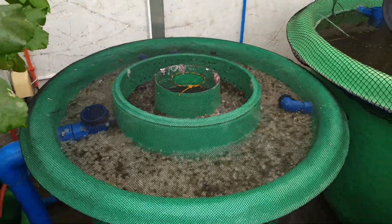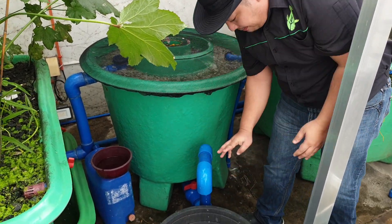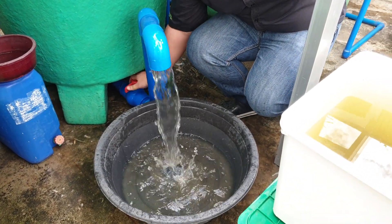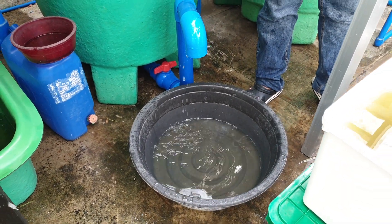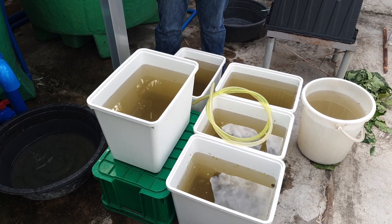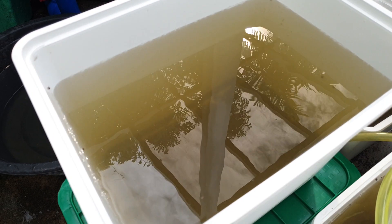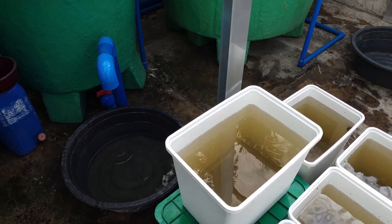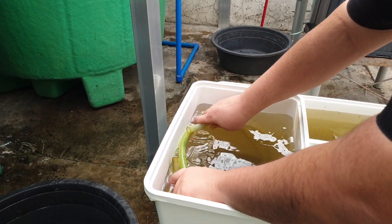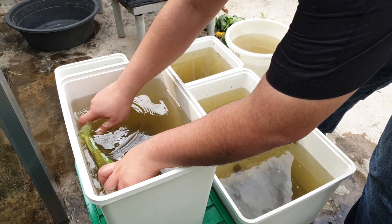Here is the drain of our filter. A while ago we used basins and pails to drain the filter — let's get a sample of how dirty the drain is. It's a little bit cleaner now compared to earlier because we already took some samples. Many viewers have been asking what we do with the solids we collect from the filter. We decant for about 30 minutes to let all the solids settle at the bottom, then we use a clear hose to start a siphon by adding water inside the hose.